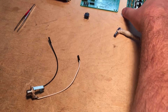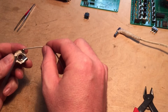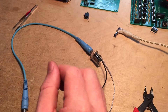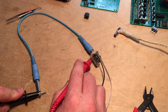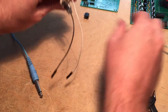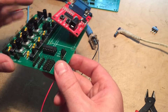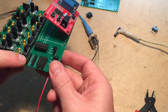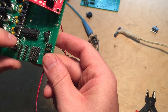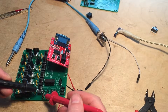The absolute simplest way to connect audio is to make yourself one of these things. I have one cable connected to the sleeve of this jack and another connected to the tip. If you plug a cable in, you can see your lead is connected to the tip and ground to the sleeve. On this test board I've installed pin headers on the expansion bay — these are all ground, and these are all the individual oscillators one through six on this side.